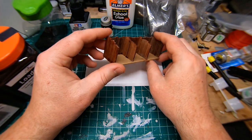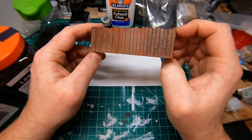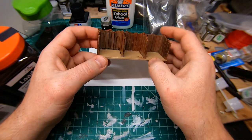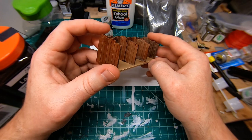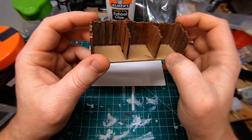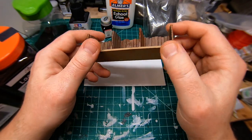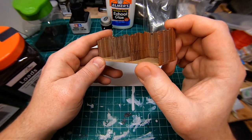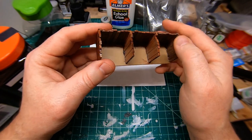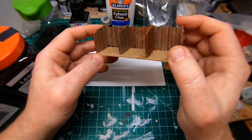Today I've got this 3D printed coal bunker that I've already painted. Earlier this month I mentioned I was going to experiment with different types of 3D printing material, and the material for November was wood PLA — a product from Hatchbox. It's basically about 60-70% plastic and 30-40% very fine wood particles. They go through the 0.4 nozzle without any problems, and the smell and texture you get after printing is basically like wood — you can't tell the difference. I hand some of the stuff to people and they think it's been carved rather than 3D printed, which is kind of cool.